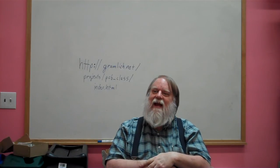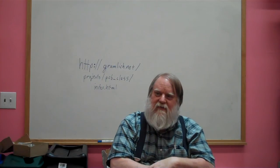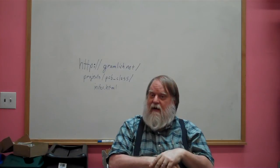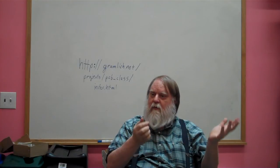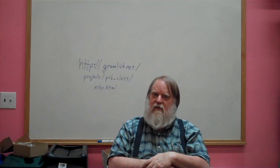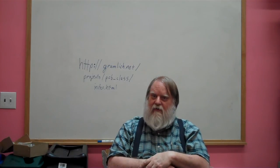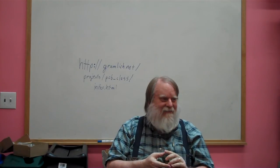Can you spell that? Eagle? No. KiCad. By the way, if you go to this webpage, there's KiCad links on there. So I just don't want to leave people in the dust. So that's the idea behind KiCad, and I tend to sort of break things out into pieces. KiCad has a Gerber viewing tool. I don't use theirs. I use one from another design package called GEDA, for GNU Electronic Design Automation. The Gerber V program, I think, is far superior to the KiCad Gerber viewer. Now, you don't know what a Gerber is? We'll get to that.